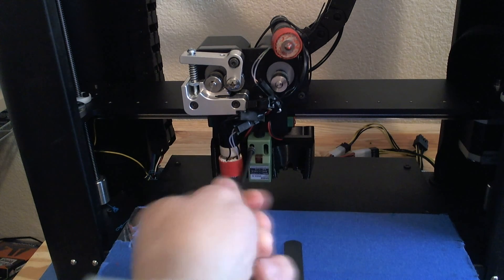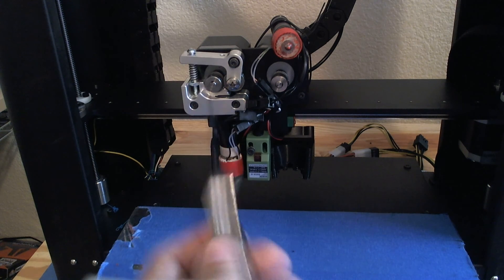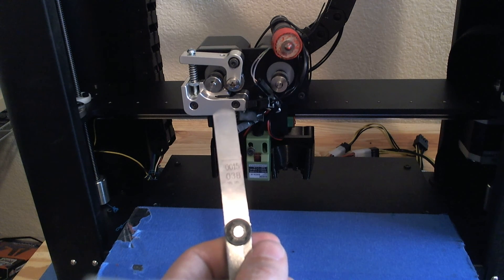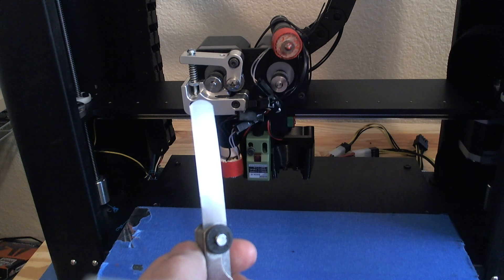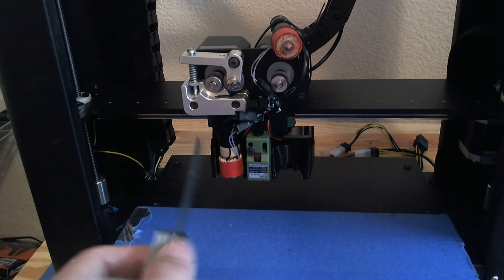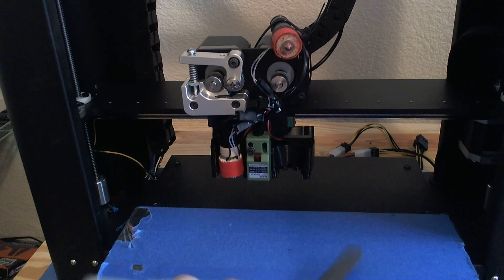So this is what I'm going to do. I'm going to loosen this bad boy up all the way so it's completely loose. Then, with my feeler gauge — because I know people would be using paper, but that's not exactly very scientific. I like scientific stuff. I've got a feeler gauge here, and you can see it is 0.038 millimeters — smaller than anything my machine can actually move. So I'm going to use this with the actual height of the nozzle to find the Z probe offset.